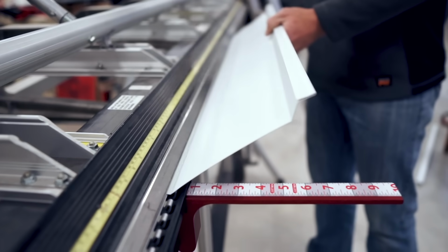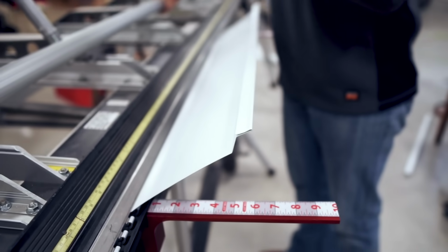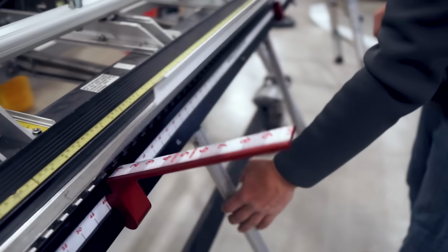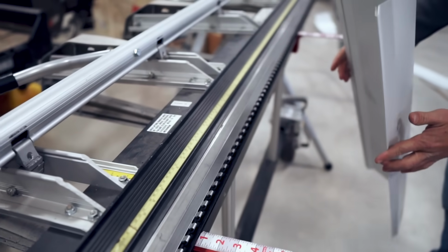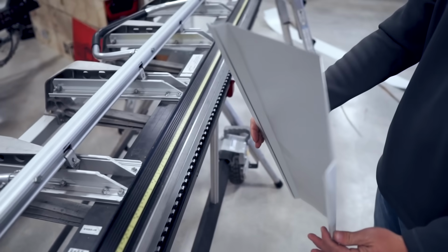If you don't like the bend, I always say bend a little bit at first, don't over bend it. Stick it back in your brake and get yourself more of a bend. I would say that's more like what I'm gonna do, which is a 4/12 on most of our buildings, but that's a nice, simple piece of ridge cap. And obviously, if you want to get really decorative, we can add a bunch of other bends. I won't do that right now. Maybe we'll do a cool decorative bend at the end.